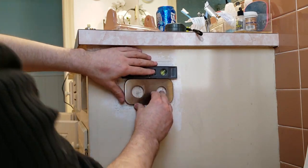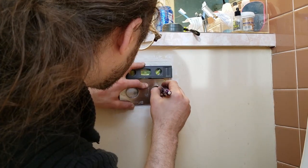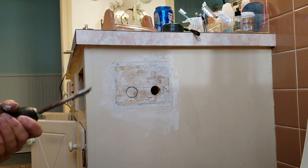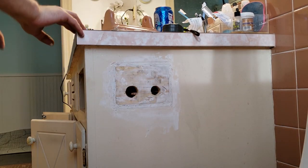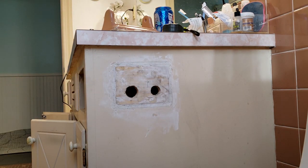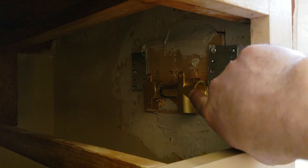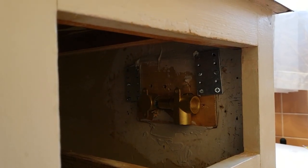Use a level of course. I can see both my top and bottom marks, so that's fine. That's a one-inch hole — sweet deal. Seems like it should fit, just a hair larger. The joiner here is interfering with this, so I'll have to relocate it. Looks like I still have space for my drawer — move that up just a hair. Let's do a little test fit with our hoses and nipples. That was a close call with that hose — it's pretty much as far as it bends. Hopefully this isn't too extreme an angle; I guess we'll find out when we turn on the pressure.